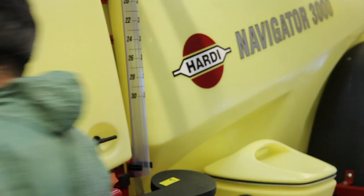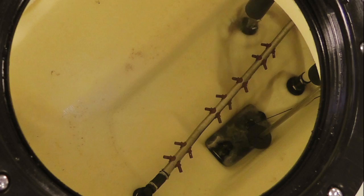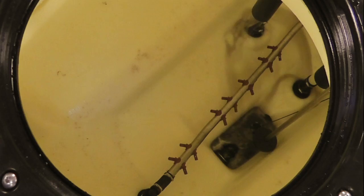I've just finished the spray job and I need to clean the sprayer. I'll do it in the field where I am now; I could also do it in another suitable area. There's only about six litres left which is acceptable. If a large amount is left, reduce the liquid returning to the tank, for example by turning off the agitation valve. The pesticide has no specific cleaning requirements so I'll just follow the instruction manual guidelines.